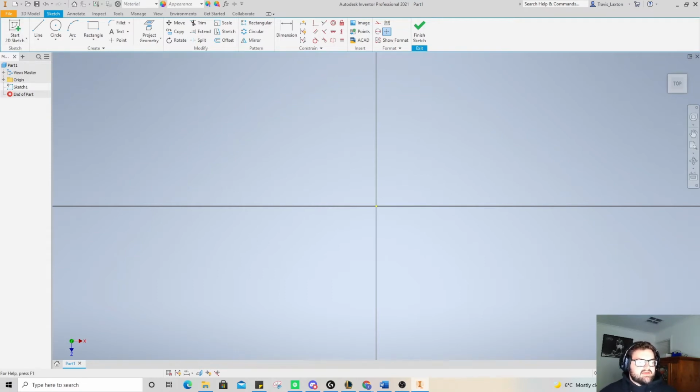We're going to make a side profile of what this looks like. So this entire thing is 25 millimeters across. Half of 25 is 12.5. So 12.5 and press enter. We want the handle to be 120 millimeters long. So moving that up 90 degrees and then typing 120. Now we've still got this attached and we actually don't, so I'm going to right click and go OK, and that way we can move on to the next segment, which is another line.